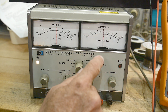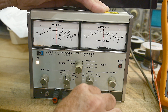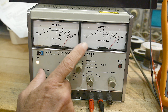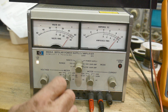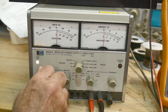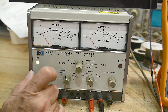If you look at the amperage — let's put a load on it. I have a 50-ohm resistor hooked up. As I increase the voltage, you can see the amperage goes up in the plus direction. Here's one amp at 50 volts. So 50 volts into 50 ohms is an amp. And if I turn it the other direction, it's minus 50 volts and minus one amp.